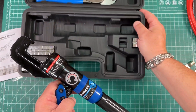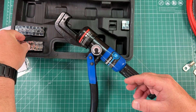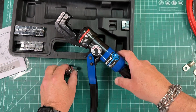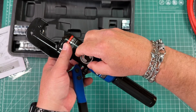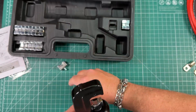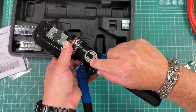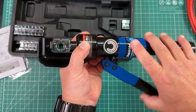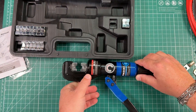The way this works is very easy. I need to crimp some 4 gauge wire, so I'm going to get out the 4 gauge dies — you've got two of them. There's a little hole there; release this tension — this is what turns on or off the hydraulic pressure. The dies just snap in with a magnet, one on the bottom, one on top. When we're ready to crimp, we tighten this down to where it says 'work.' Just press this lever and that's pumping up the hydraulic pressure, and you can see the crimp getting tighter. Then you release it and it goes back down. Very effective at crimping.